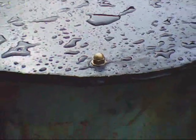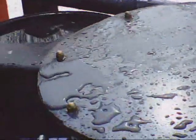We're actually building another gasifier for my father. I think what we might do is have the heat exchanger sit the full length on the truck bed with two access ports, one here and one at the bottom, so the whole thing can fill with char before you need to clean. Right now I clean about once a month - probably a bit more often than the book recommends, likely because I'm pulling harder on it. For the heat exchanger top, I used a big flange system again, same as the hopper lid, with the gasket.